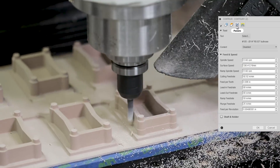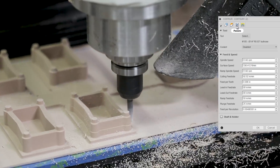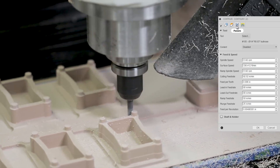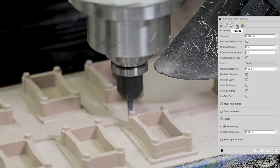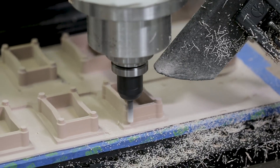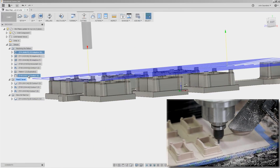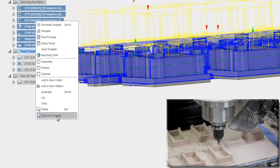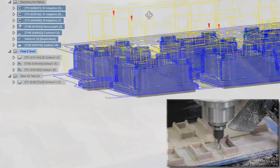We're using a bullnose end mill — a quarter-inch tool with a 30-thou bullnose radius. We're going pretty quick: all the RPMs we've got, which is 5,140, and 6 thousandths of an inch feed per tooth, about 90 inches a minute, taking 20 thousandths of an inch maximum step down. Make sure to leave smoothing checked. There's a card linking to the NYC CNC page where we've taken all of these CAM operations and turned them into a Fusion 360 template you can download to better understand and apply these toolpaths to your own casting pattern.